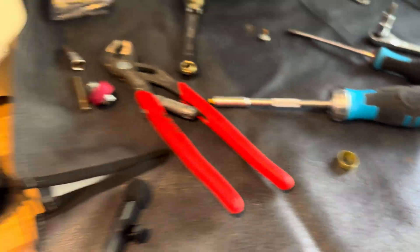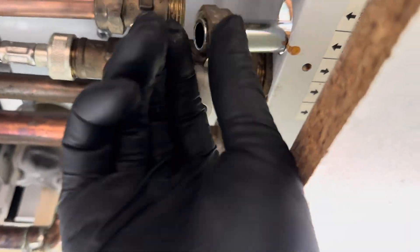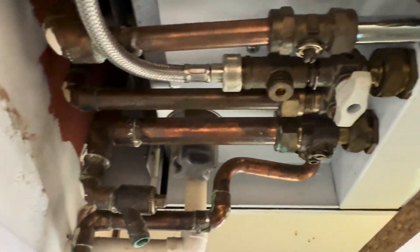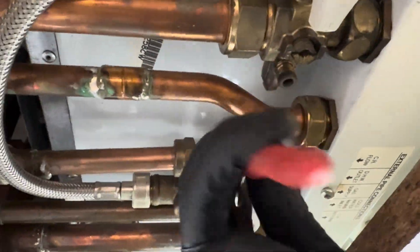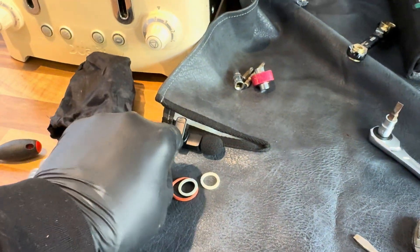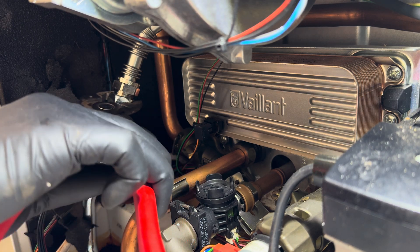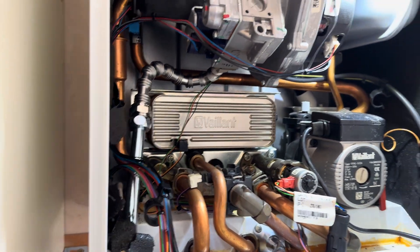Let's go get a new olive. Good thing about always carrying caps in the tool bag — sure enough there's one on hand. Obviously tighten this nut under here. Let's change this while we're here too. Okay, gas is done. So let's get on to the heat exchanger.